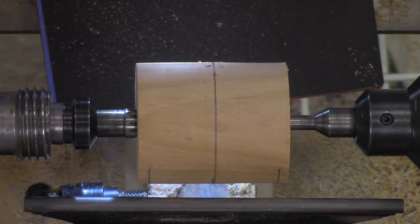And what did you cut the disc with? I started out drilling a hole on the drill press. Right. Okay. And then I cut those pie segments with a scroll saw. With a scroll saw. Yeah. And I think it was a puzzle blade. I couldn't see the teeth on it, but I could feel some roughness on it. Puzzle blade.